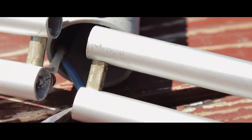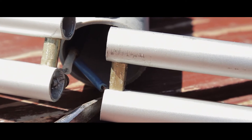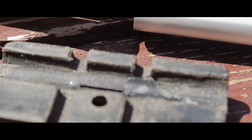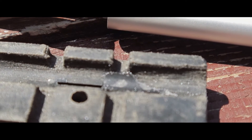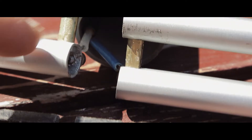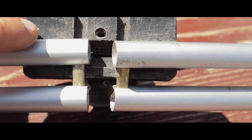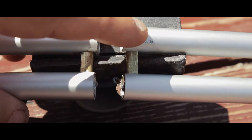Since both 70cm elements are connected together, I then connect the outer braid of the coax cable to the 70 centimeters element on the other side. I'm holding everything together with some plastic parts recovered from an older TV antenna my dad built — I cut a little bit to pass the spacers through, then cover everything with another piece. The whole assembly then screws onto a PVC pipe.